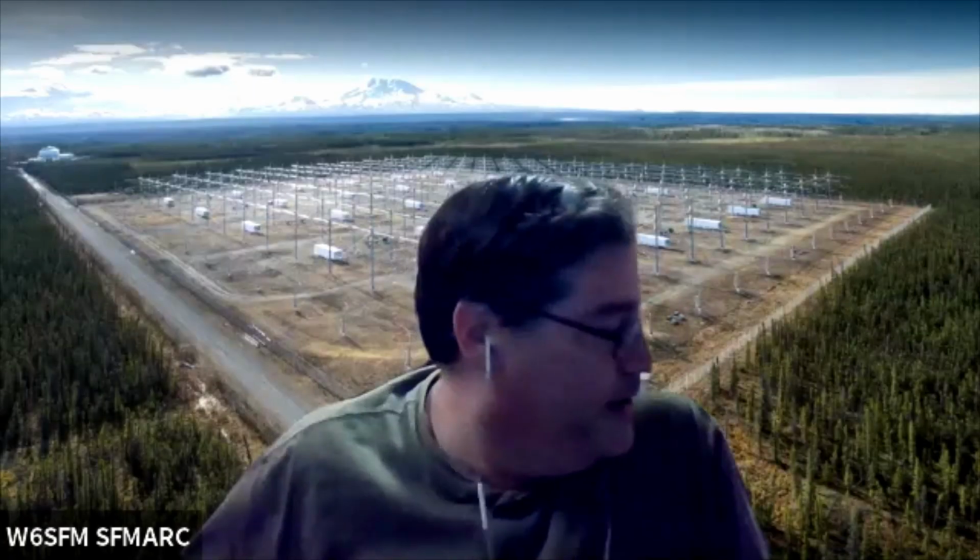Well, I hope on the next windstorm he keeps it up so we can test it again, see if they've figured it out and corrected their error. Well, he and I talked the night before when they had the winds. Are you going to put your tower down? No, I'm not. Mine stood up, but I have definitely decided that 40 miles an hour is my limit, although it's supposed to be good for 90. At 40 miles an hour, I'm going to bring it down. Yeah, that's what I used to do. I had a 60 foot, and I'd crank it down when it got really windy. But mine was also guyed, so I wasn't as worried about it.